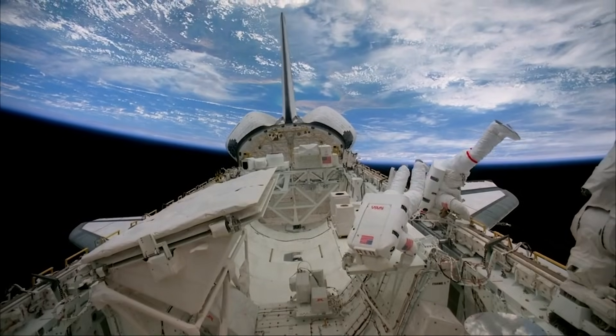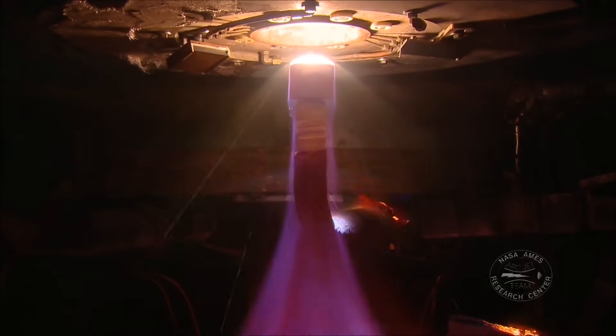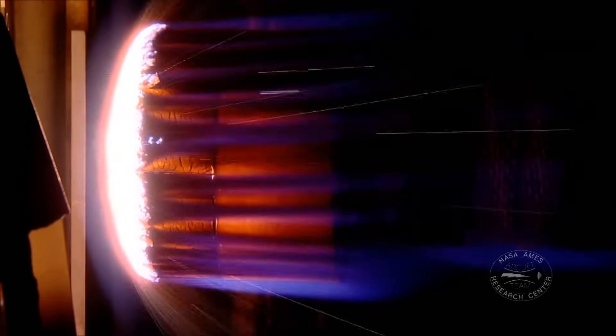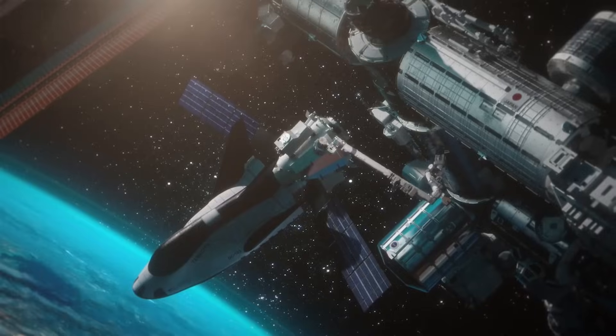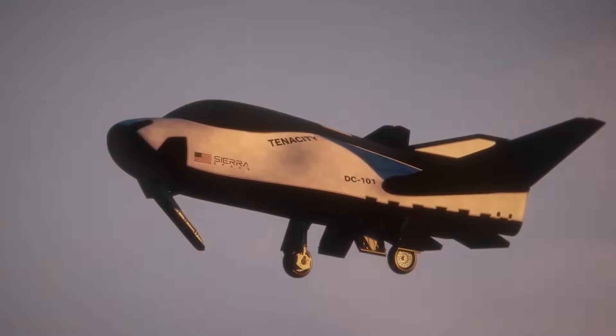All of this works to improve upon the Space Shuttle's design. Starting all the way back in 2015, Sierra Nevada Corporation, the parent company of Sierra Space, successfully completed several significant TPS material development tests for its Dream Chaser spacecraft. The TPS tests were completed at NASA's Ames Research Center and Johnson Space Center under reimbursable Space Act agreements. The tests provided critical data needed to support the TPS subsystem Critical Design Review, or CDR, and to validate Dream Chaser TPS manufacturing readiness. Over 100 arc jet cycles and radiant heat tests were completed at Johnson's Radiant Heat Test Facility and Ames Aerodynamic Heating Facility, providing results supporting thermal characterization of the developmental TPS materials and gauging material performance in environments simulating Dream Chaser flight.